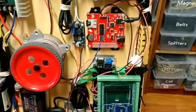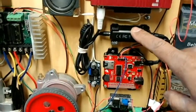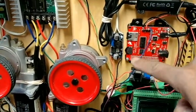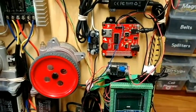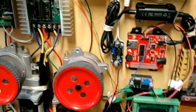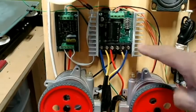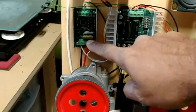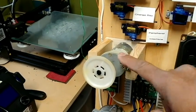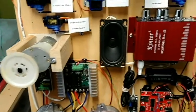Right above it I have my MP3 player and a ground loop isolator for noise pops. I've put a 5 volt regulator in, but eventually I'll go with a larger regulator that will handle enough power for all of the body electronics. Over here I've got my Sabertooth for the drive motors, and then I've got my Syren 10 for the dome motor. For a temporary dome motor, I'm just using this motor here that will spin this disc to show that it's working.